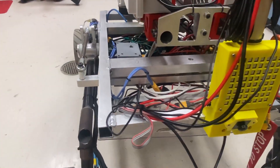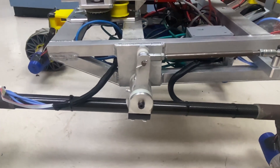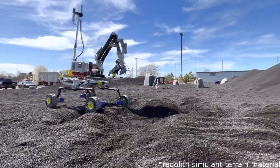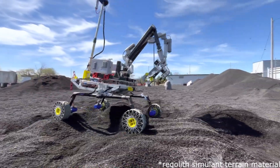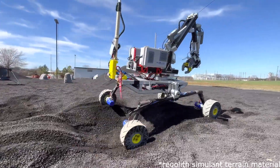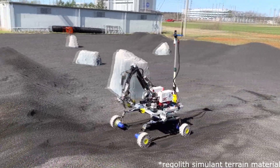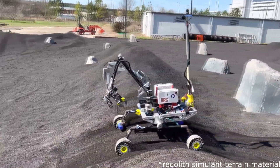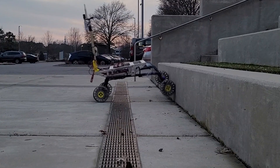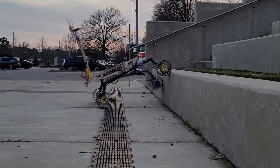With the newly developed carbon fiber suspension and inline drivetrain system, the rover has seen an increase in traversing performance. The trapezoidal suspension geometry increases the ground clearance, allowing the rover to successfully drive over more hazardous obstacles. The drivetrain system uses NEO 550 brushless motors integrated with the 64-to-1 planetary gearbox, providing each wheel with a stall torque of 62 Nm — a major increase compared to last year's system, allowing the rover to drive over curbs and climb vertical faces.